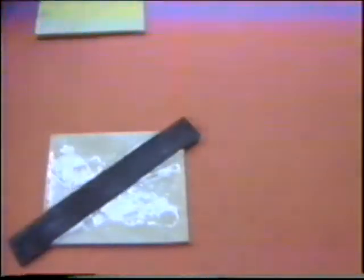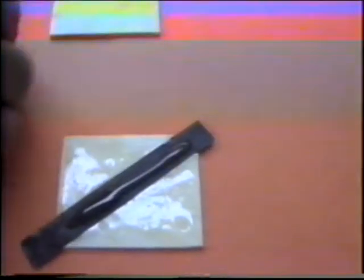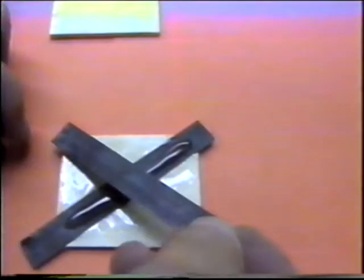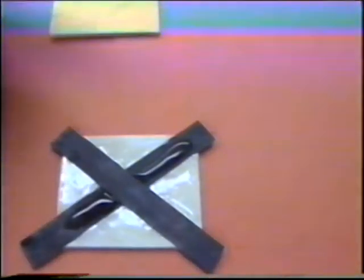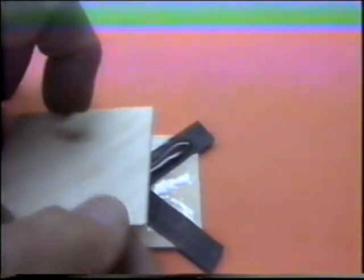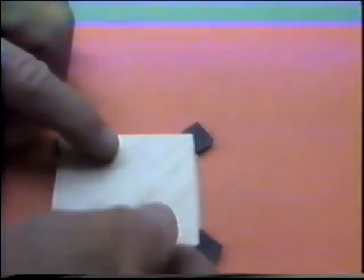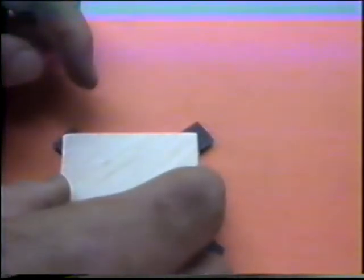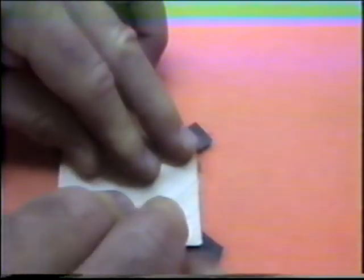Always corner to corner. That's the whole thing in a nutshell. Corner to corner is what you want to do. This might even be a little stronger if you did it with epoxy, I'm not sure. Now you notice the grain is going in the opposite way. And then we'll make up a third piece once I get the final fit. I don't want to lay three of these together with the grain going side to side.